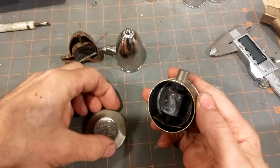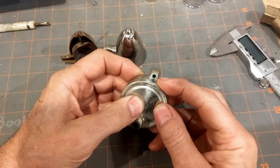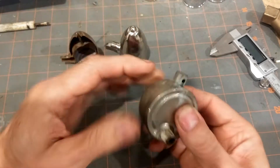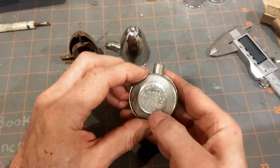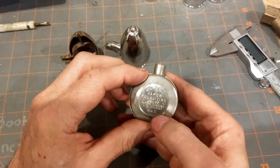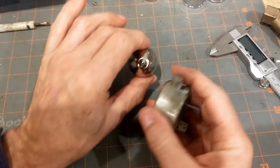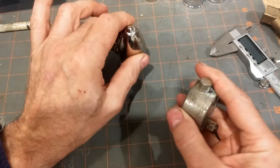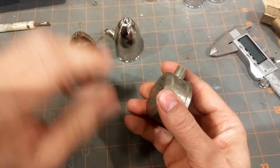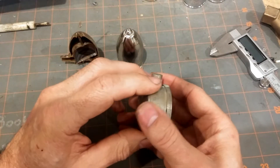These vents tend to come in larger vent sizes. You can see there's a massive difference between the holes of these two. This one is type C as in Charlie. They come in number 4, number 5, number 6, C, and then D. Number 4 is a tiny pinhole, generally smaller than the Hoffman 40. Number 5 is roughly equivalent to the Hoffman 40. The 6 is definitely larger.